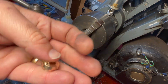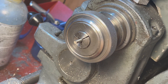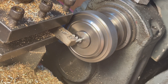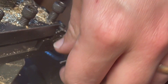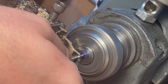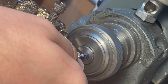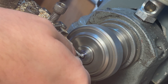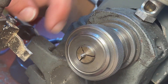Oh, that's super hot! Let's tidy the back of that up and then we have another part of the traction engine done. Let's try this again — I've sharpened up the tool in the meantime. That worked much better with the sharper tool and the surface finish isn't too bad. It's just time to part this off. No dramas at all. I've got a 1/16th collet here holding the shaft I just turned and that's going to tidy up the end.